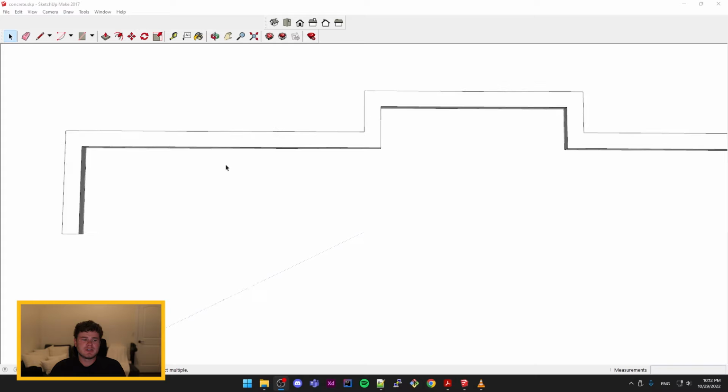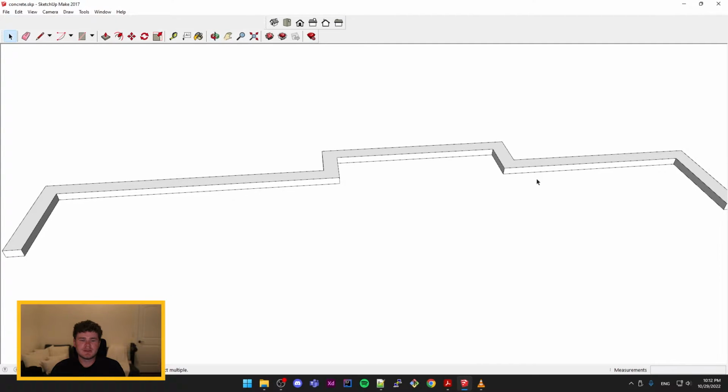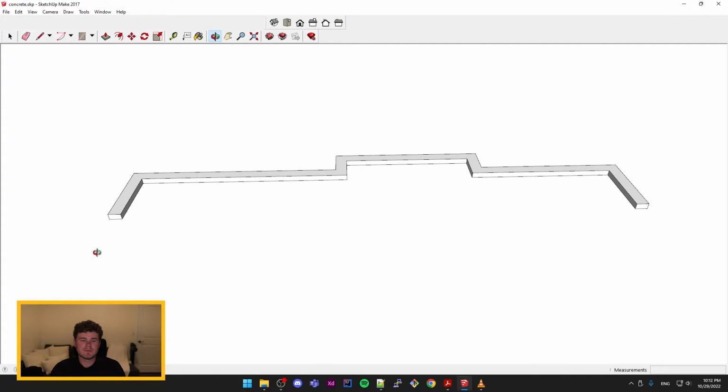But this is what we did. This is the first thing we did. We poured a footing. This footing is 8 inches thick here, 16 inches wide. A footing is basically a solid place that touches the ground. The bottom of this is on the ground, in the dirt. It's formed. We formed it with 2x6s and then just used 16-inch cleats to hold it in place.